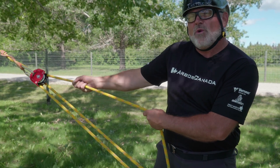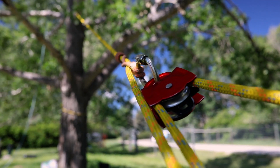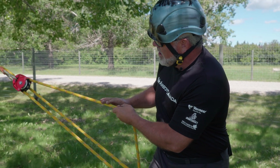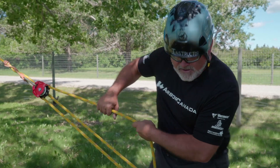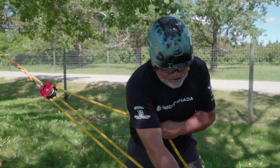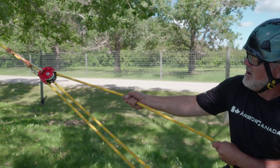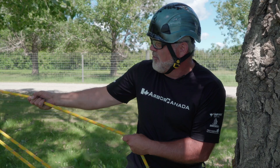It is a fact that you can pull your own weight on a slow, steady pull, which is how you want to pull a tree when using chainsaws. You don't want to be jerking or tugging — that creates shock load. My 200 pounds here translates into 200, 400, and 600. I simply count the parts of rope acting on my tree. My 200 pound input force here translates into 200, 400 anchor force. So I'm putting more force on what I want to do and less force on my anchor, and I'm moving away from the tree that I'm pulling. I have now reaved mechanical advantage and I know my input and output forces.